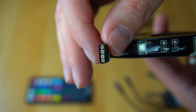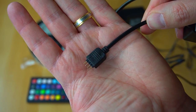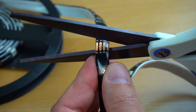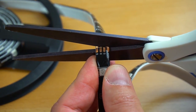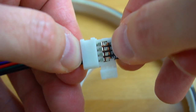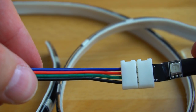Both ends of the LED strip have four-pin female RGB receptacles, which means you can cut this in half and power one end with the included power supply and the other end with a compatible 12-volt RGB 5050 power source. If you want to chop this up into even more pieces, it's incredibly easy to do. There are cut points roughly every 4, 8, and 12 inches. The rubber coating on the front is really easy to pull back, and the double-sided adhesive on the back scrapes off effortlessly with your nail. I also found these really neat solderless connector wires that make adding connection points a snap.